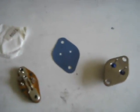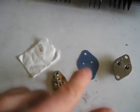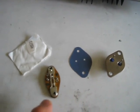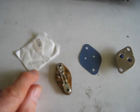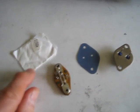Here you go — that's what all this is. This is the transistor itself, and when I purchased it I also picked up these pieces. Sometimes they'll give them to you for free, sometimes you have to buy them. This is a washer, this is all the connection stuff for the other side, and this is some thermal grease or thermal paste — it's thermally conductive but electrically insulative, so it won't conduct electricity.